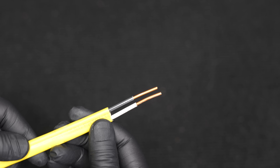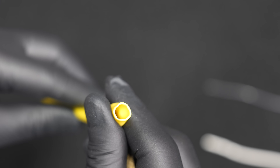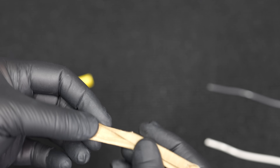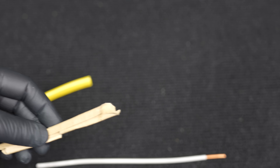Here's the bonus question: say you've got some non-metallic Romex cable lying around — why don't you just cut it apart, pull those wires out, and now you've got your individual conductors? You might think that is the perfect solution, but unfortunately you would be wrong. Those wires were designed to be inside of that sheathing. Without it, they don't have the correct protection that the manufacturer intended. That's not allowed in any situation and is not safe.